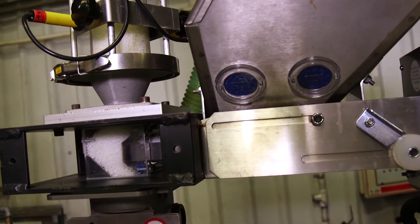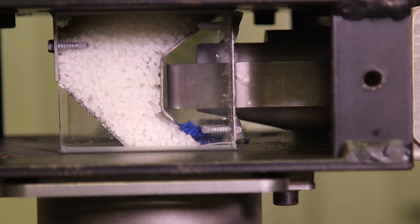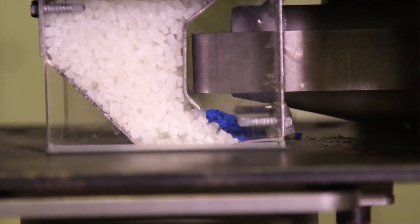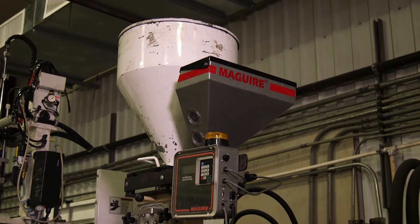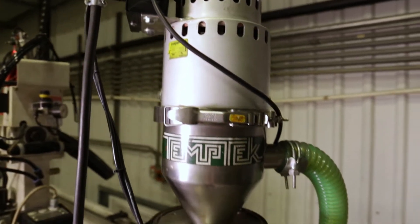The other method is using a piece of machinery at the feed throat of the injection molding machine to dose color into the natural colored plastic resin. The gravimetric blender disperses the exact amount of color concentrate by weight to the natural material, yielding consistency from part to part.